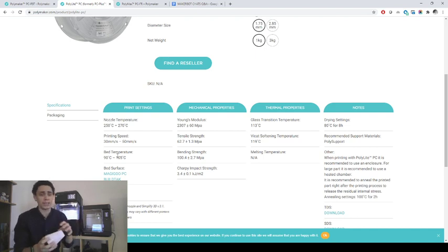I'm sorry, it's kind of dry here. Cracking between your layers. It's going to compromise your prints, and ultimately it's just going to be a headache. So it might not be required for this one material. I still strongly recommend only printing it with a heated chamber because of that. I've seen it where you basically touch the part, press it upwards, on some of the components that we're not printing up against the heated build plate, and the part just cracks. It just cracks. You have that consistent performance throughout the whole height of the part with a heated chamber.